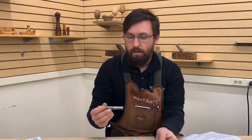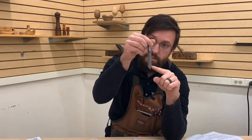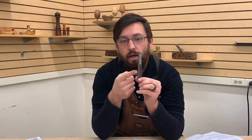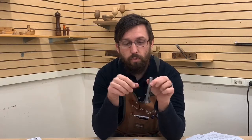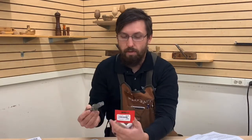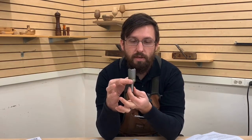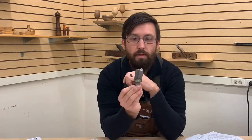You can get the same thing in a half inch shank. A half inch shank flush trim bit has the bearing on the cutter end as a bottom bearing. You can't do a half inch cutter on a half inch shank as a pattern bit — there's no place for the bearing. So if you want a half inch shank pattern bit, you have to go to a much larger cutter: we've gone from a half inch cut diameter to an inch and an eighth. On a half inch shank, that larger cutter allows for a larger bearing, flush cutting, and that is a pattern bit — a massive bit.